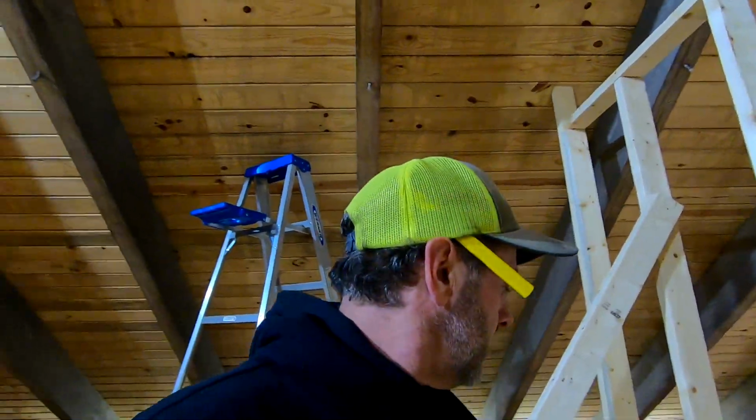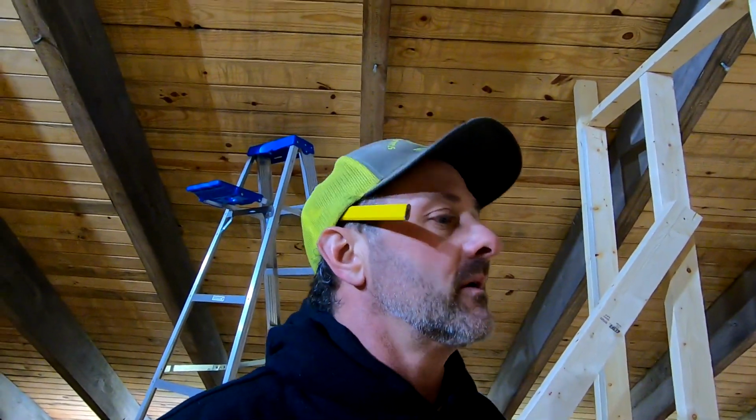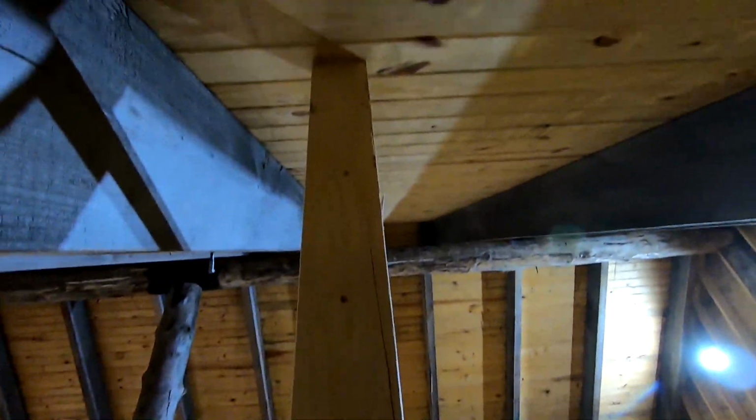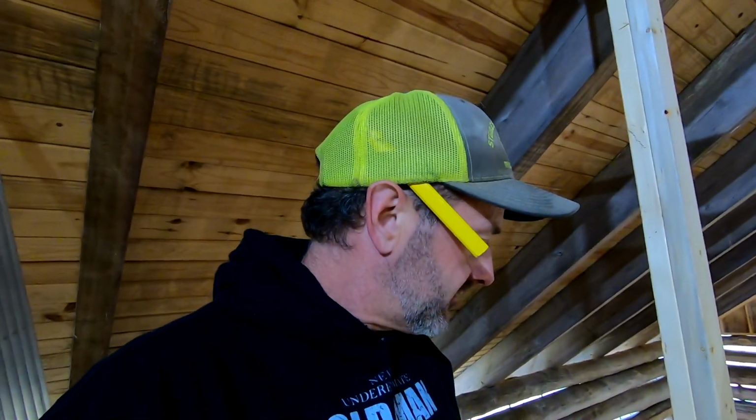So what we decided to do was we tore the wall back down, laid it down, and we moved over. And it shifted where our doorway was a little bit, but no big deal. It moved us over to where now we're centered up on this other tongue and groove on both sides. Now, running trim is not gonna be that big of a deal. We're not gonna have to work around any of this other stuff.